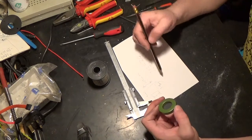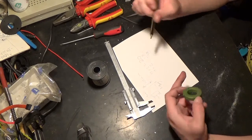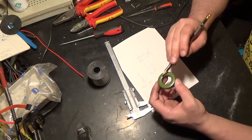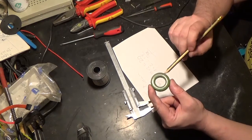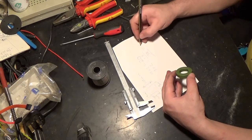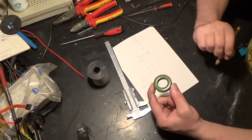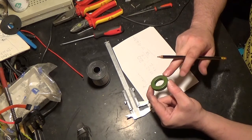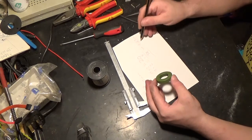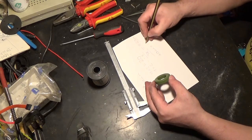Okay, now, you could round this up and say 10 by 10 or whatever. So effectively, 1 turn would equal 40mm of wire. That would include the bend radius or whatever. So, taking that bend radius into account, we can assume the approximate value of 40mm of copper wire to 1 turn. We want 14 turns in total, so that would be 40mm multiplied by 14.